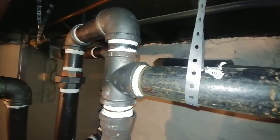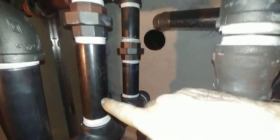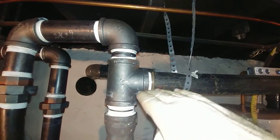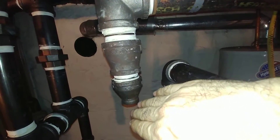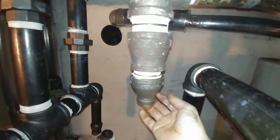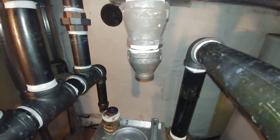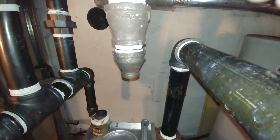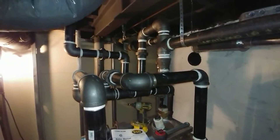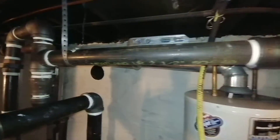What we've done here — this is not necessarily the ideal way, but I believe it should work. Steam rises and goes out this way; the condensate then returns and can separate down this tee. You can see it's been dripping all summer. This will then be sent back to the return line before the Hartford loop and equalizer line. So in summary, we have two parallel flow mains and one counter flow main.